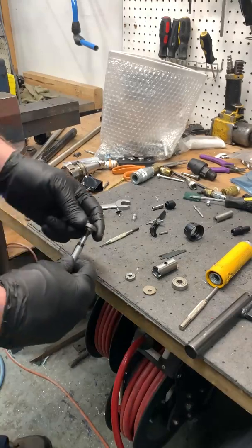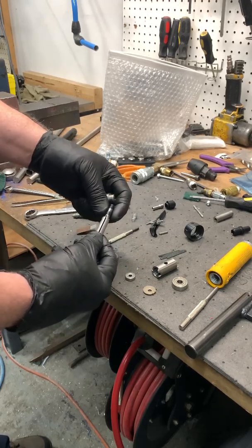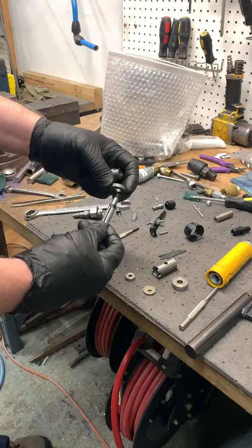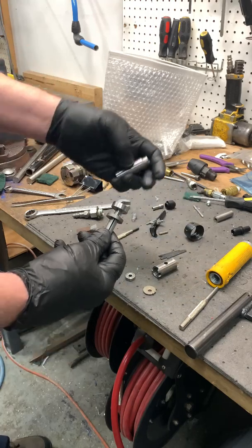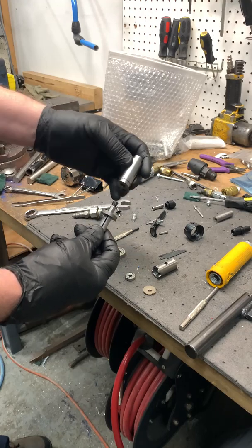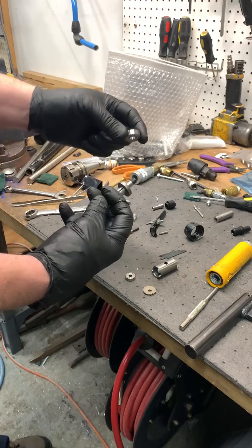Okay, next we're going to press the front end bearing on. So I have the rotor, the spacer, the front end plate with the flat side down towards the vanes, because that has to be smooth for the vanes. The front end plate goes on, and I have a mandrel. The bearing goes on, and then you press it on with the mandrel. Be sure your mandrel clears the shaft, and also be sure that the mandrel presses the inner race of the bearing and not the outer race.